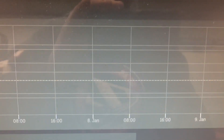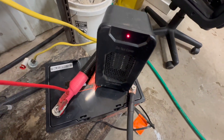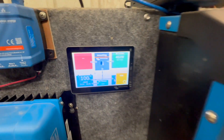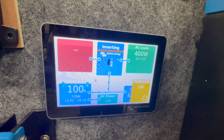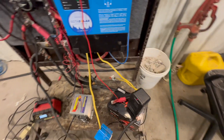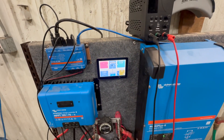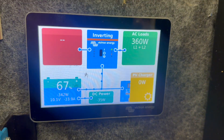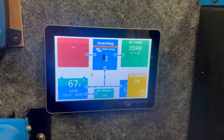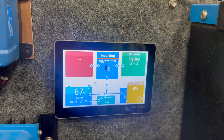We've got a little heater going here for the capacity test — pulling about 30 amps right now, which is a perfect draw for this little battery. We'll log it all and see where we get. We are coming up on low voltage cutoff — 10.1 volts being measured.